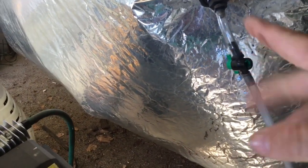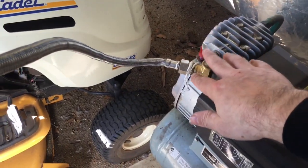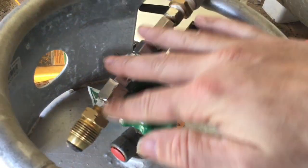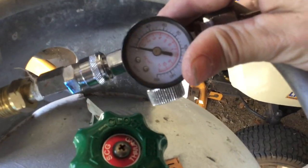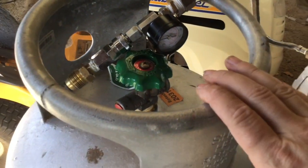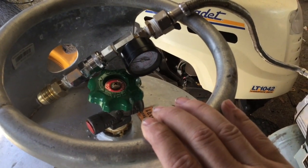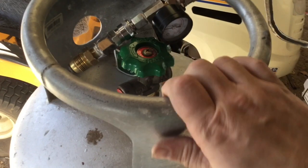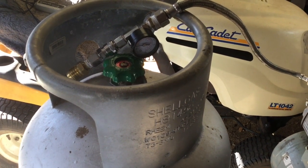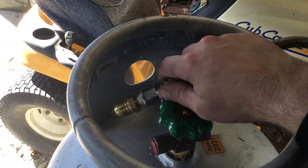I hook that up and turn the valve on. There's also a video on just the fittings I could find to match up into my connector piece here, which has a pressure gauge — unfortunately it only goes to 160. I know these tanks can go up to about 260, but compressing biogas to that sort of pressure — like propane — requires cooling, liquid nitrogen and that, so it's not really viable for a backyard setup.